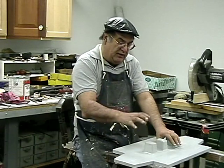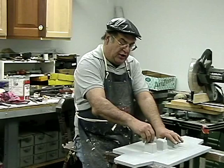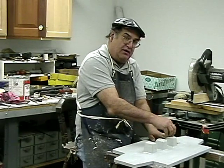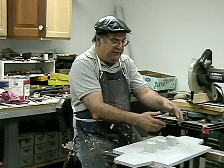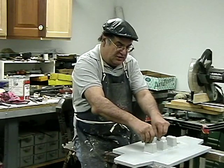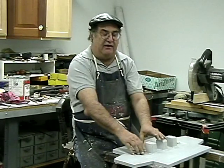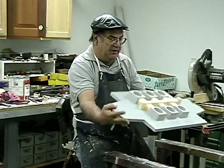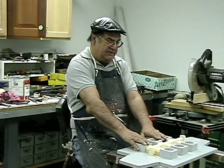And now, when the thing starts to solidify and cool, the shrinkage is going to occur in these risers. It's going to keep feeding as the metal starts to cool, and it's going to shrink these. There's going to be a big hole in the center where it kept feeding down into the part. Now, it's a lot of metal, but that's what you need to get good sound castings. They call it sound castings.